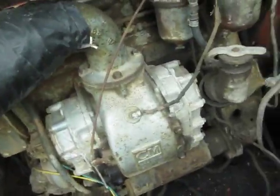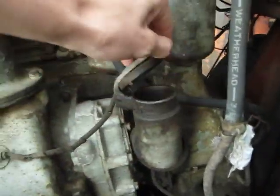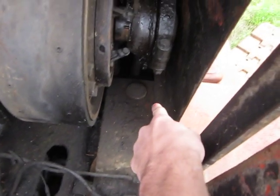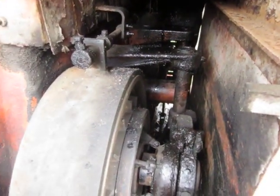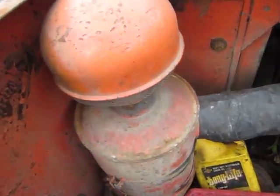Here's your Detroit and I'll show you a couple things on this side. This is where you put your oil in. This is where the ether pre-heater injects into your blower assembly, and here's your filters. Right down there is your diesel fuel cap and your two clutches. If you see in there that middle shaft, that's where a reversing shaft would go if this machine was set up with a shovel front, which it is not. Right there is an oil bath air cleaner.